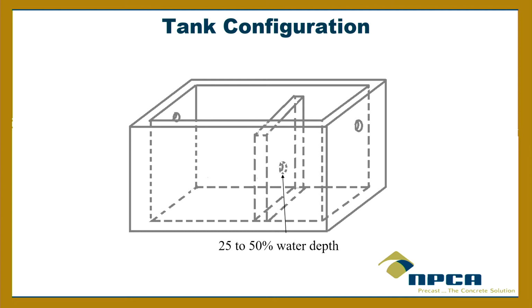Most of the stuff you talked about seems to be about conventional tanks, correct? Yes. I've seen several problems on the aerobic system where they're 4 chambers. A lot of that doesn't apply to it, but at the same time, where you have that mid-seam, I've had it where the mid-seam goes bad and the aeration tank is mixing with the trash tank.